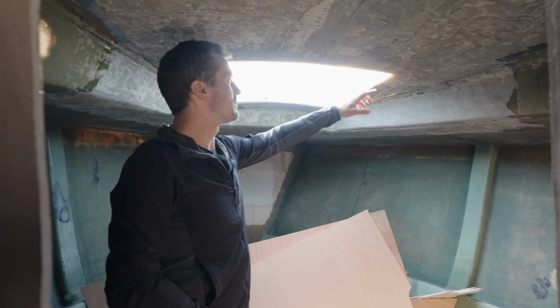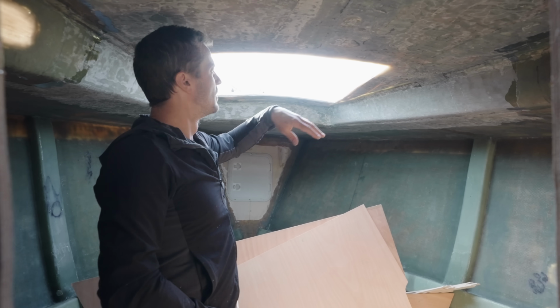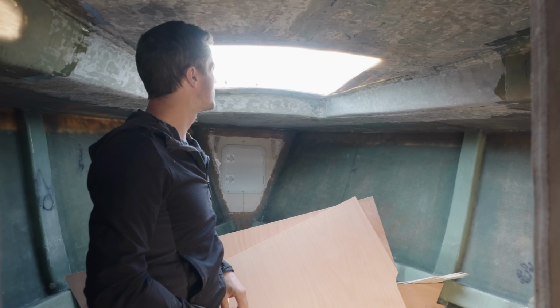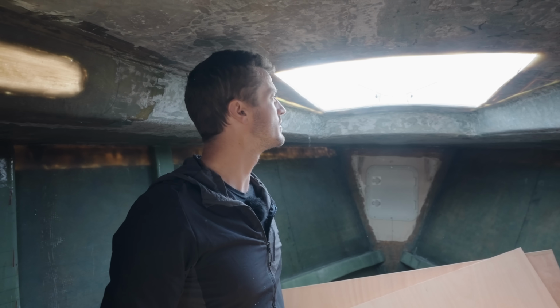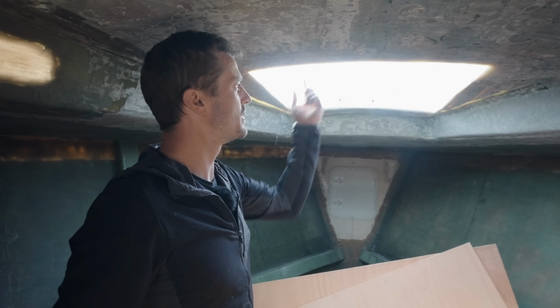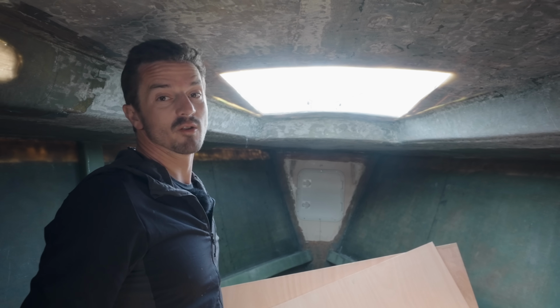So we're gonna match that thickness probably with just some plywood, and then maybe do the same thing, just fill it full, like 6 layers of chop strand first. It's probably easier to do it from the top than it is from underneath after. So yeah, maybe we'll just do chop strand. That seemed to work okay. But yeah, cover this in plastic, screw it up in there, and then start glassing from the outside again. That's the plan. Should go faster today.